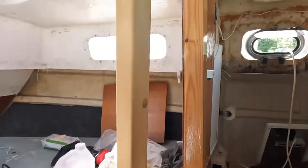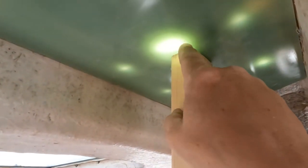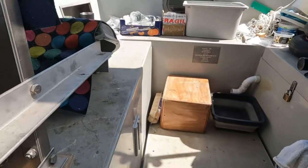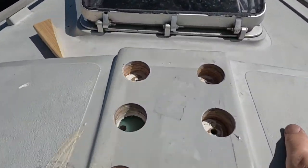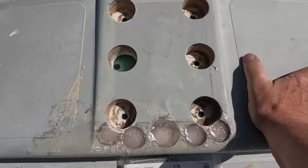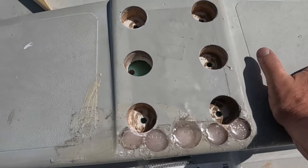I've got the FR4 wedged into place and I can just about see the black mark I drew on the hole that's been enlarged full size all the way through. I'll go and look on deck to see how well that lines up with the centre of the hole. Well, I didn't quite position it far enough to port, but in terms of fore and aft — which is the critical dimension — that's spot on. I can go and drill all six holes now. Fantastic.